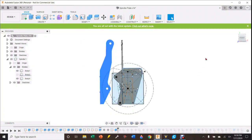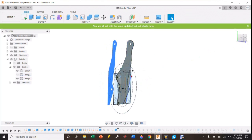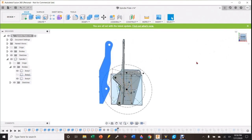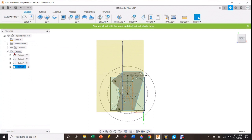Here's what I love about Fusion 360 — now you can see the parts you're going to be making before you start cutting them out. This is the spindle upright. This is going to be a quarter-inch plate. It's 16 inches from the lower uniball to the upper uniball. You can see this kick out here a little bit — that is where it will clear the rim, the tire, and everything. It will be boxed in on the front and the back. Here's the plate that holds everything together; this is where it mounts to the spacer we made earlier. Here's the brake mount — it clears those bolts right there. And this kick out is for where the steering is going to be mounted. I'll go ahead and brace that really good so we don't rip the steering off. Let's drop this into the Langmuir Systems CNC plasma table and cut these parts out.